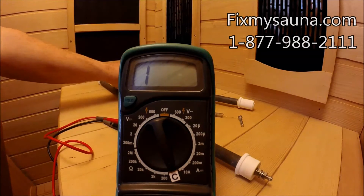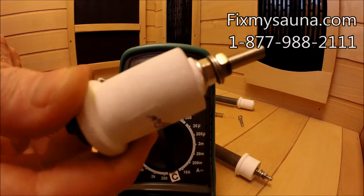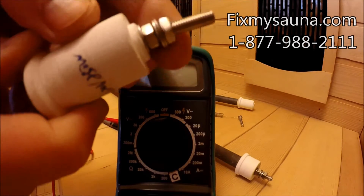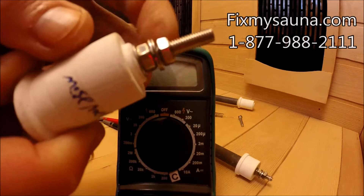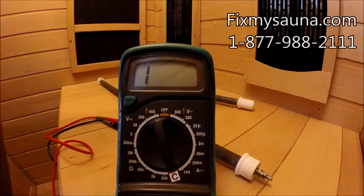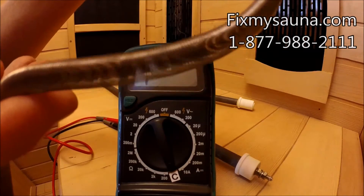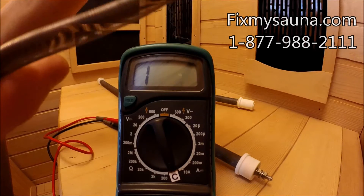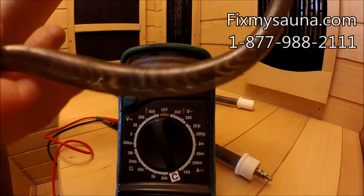So how are these ceramic heaters manufactured? They've got a ceramic top, or a pole on the top and the bottom. It's got screws here that screw in your wires — usually they have washers. This is your pole position, this is the top of your pole. Inside you're going to have a coil wire, and that coil wire looks very similar to this. Some are a little different — some are coiled smaller, some are larger coiled — it just depends on the manufacturer.